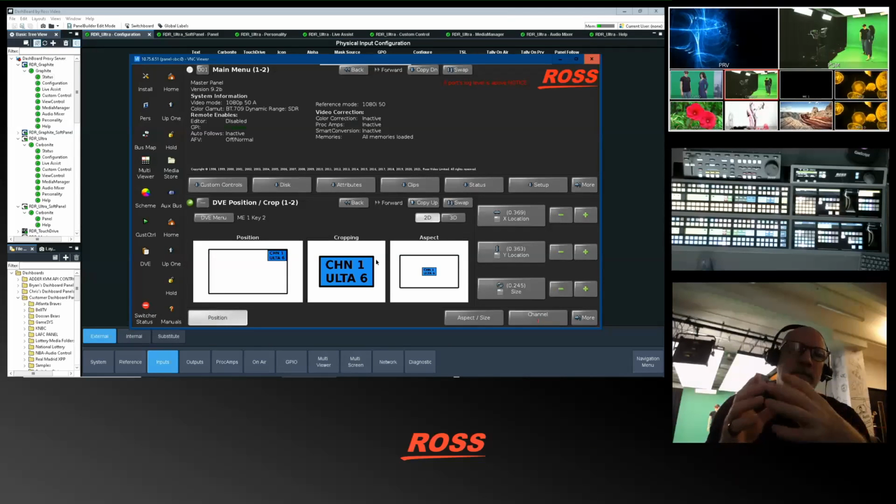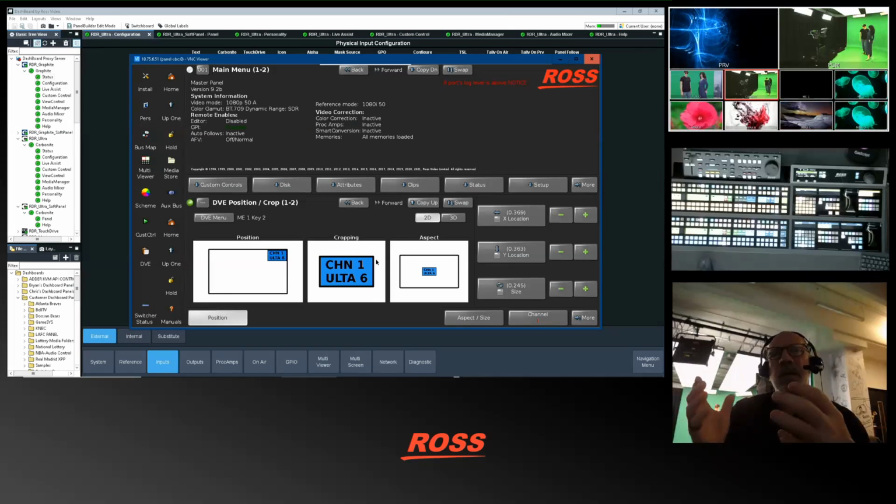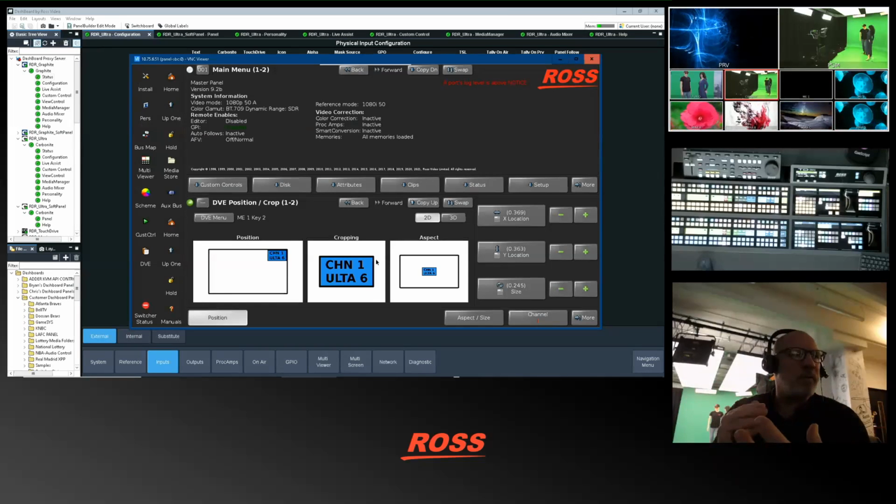Especially when UHD first came into play, all our cables were only capable of 3G signals, if that. That's where the whole conversation happened about, we need to do something about this, what are we going to do? And then the whole IP world came into it. But now we've pushed forward in terms of the cabling. Arguably the cabling is thinner but capable of taking even more data, 12G. That was the main nugget of change, really, to stay with copper.